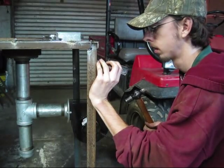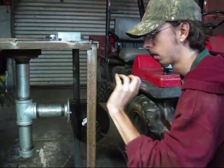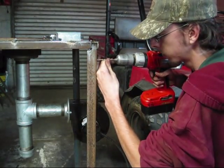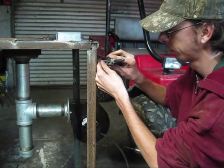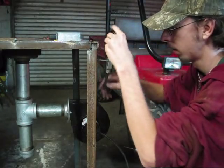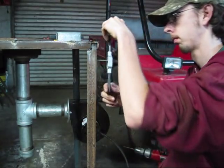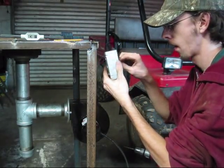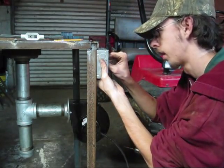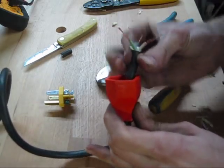Now we're ready to wire. For the very start, just take your center punch or an awl and scratch where you're going to drill. Then take your drill and drill your two pilot holes — that'll be for your threads. Next, take your tap and tap them out. Remember, you don't have to do it this way; you can just put bolts through there with nuts on the back, but this method was a little easier for me. Then take your bolt and your box and hang it on the side of the forge.